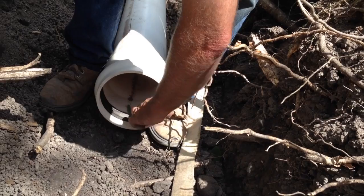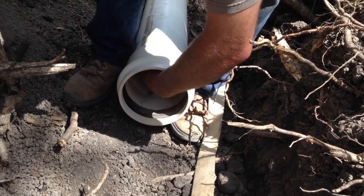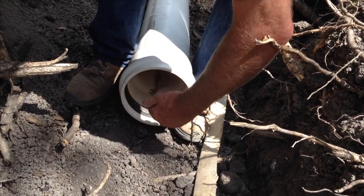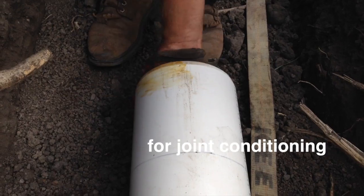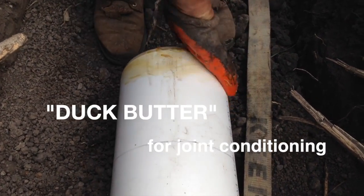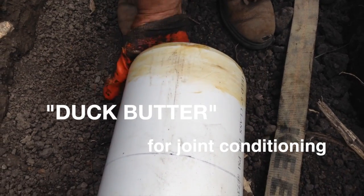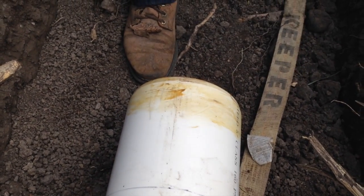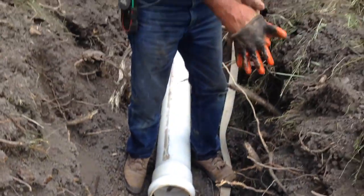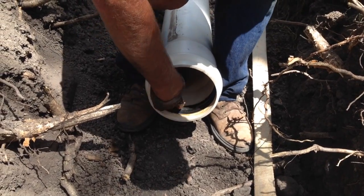In the long run, that makes for a better seal. It keeps that out of there so that the water can get in behind it and squeeze onto the pipe. You want to get it around the front edge — the front edge is most important. Just get it to where it starts to seal without pinching that seal. Fresh duck butter.